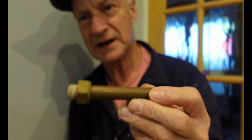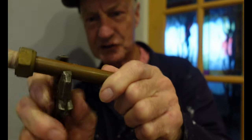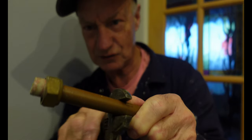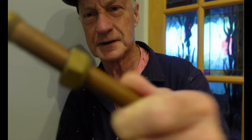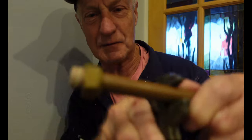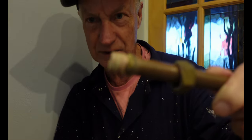So what are the options? Basically there's three. First one: if you've got a bit of room on the pipe, you've got a bit of length and it's fixed, you could get a spanner, take it down to just above the width of the pipe, and then start knocking like so. And hopefully if you're lucky and it's not too tight, it will come off. In this instance you can see it hasn't budged much — it's gone a tiny bit. Probably if I kept on it... but I want to show you the other ways to get it off if that won't do the trick.